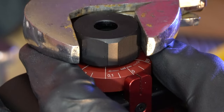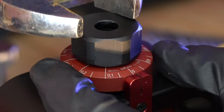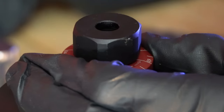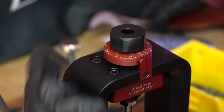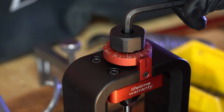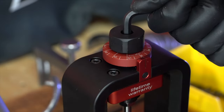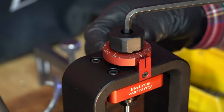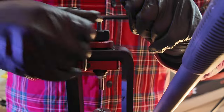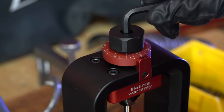Notice I'm holding the indicator and tightening that top bolt down just a little bit to keep it from moving. Those two O-rings in there are creating a friction hold. Now I'm going to show you quickly how that is adjusted — you're never going to touch that nut on top again. Instead, when you're ready to adjust it, you're going to stick an Allen wrench inside there. As I zeroed it out it's a little tight to get in there at first, but then you can turn it and that will adjust the height of your die counterpart in the press slug. On the back, once you get it set wherever you want, there's a locking nut, and you can use the other Allen key included in your kit to tighten that down, which will prevent any movement during the slug making process.